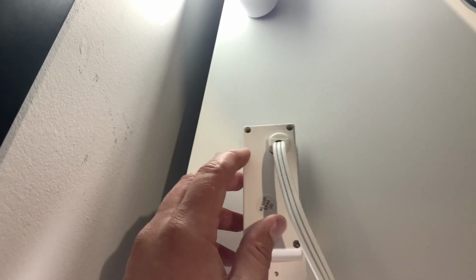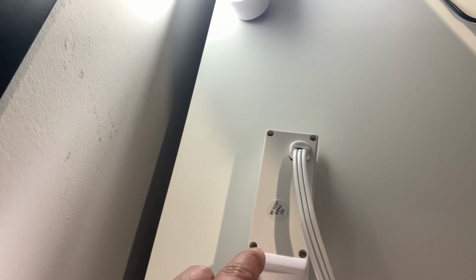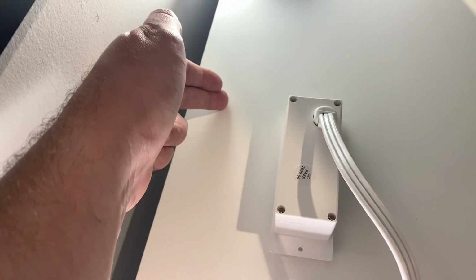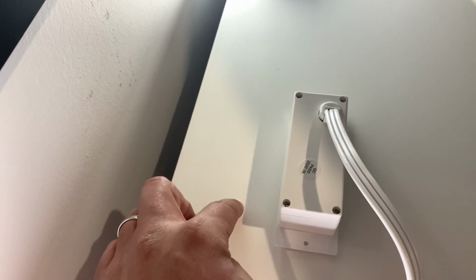What you want to do is measure here, then draw here, but draw a little bit smaller than this. You'd take off about a quarter of an inch on each side, because when you cut the hole, you don't want it to be too big and have this rattling around. You want it snug. If it's too small, you can always take the jigsaw and widen the hole a bit. You can't reduce the hole, you can only widen it. So always start too small.